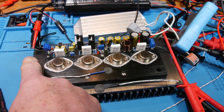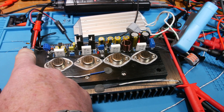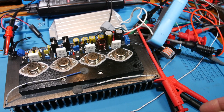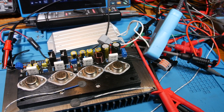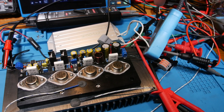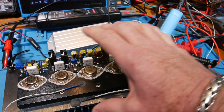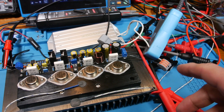This is the input signal coming in from the GW INSTEK, and the scope is also from the GW INSTEK. On the output we have our current probe, differential probes on the output, and a scope probe from the GW so we can compare the spectrum from the input and the output. I also have the THD meter coming in here. There are the plus/minus voltage rails — I'm still using the lab power supplies because I'm controlling the power coming in, so we don't have the real power supply interplaying right now. That'll come next.